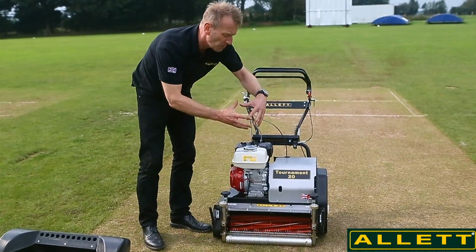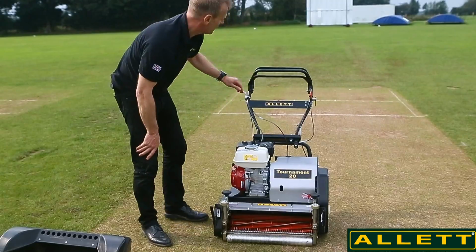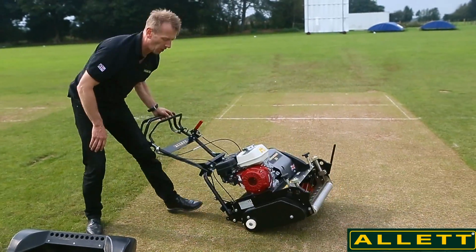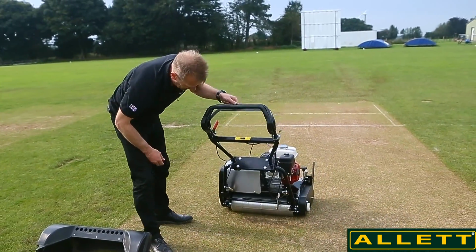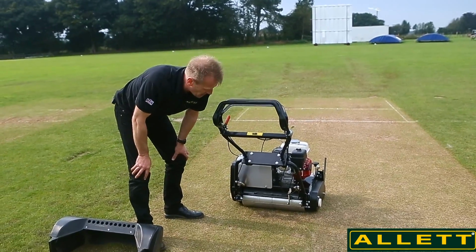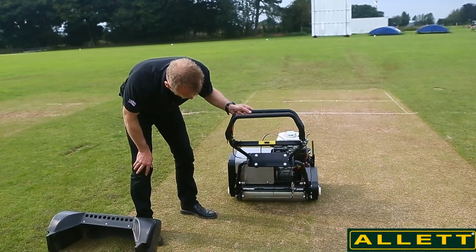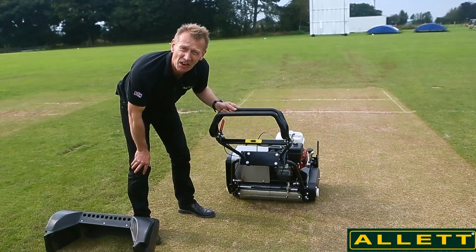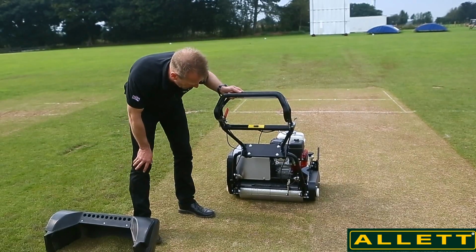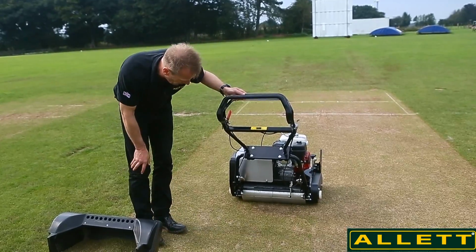Lightweight is critical, and although the machine is very strong and robust, we use light materials wherever we can. For example, the rear roller is constructed of aluminium. It is also split, which gives us a differential. That differential drive allows us to turn and straight line very easily while delivering the tractive power to that rear roller. There is a scraper on the rear roller too.